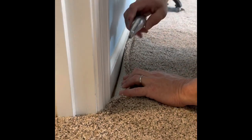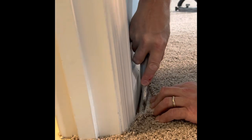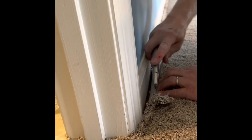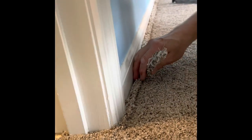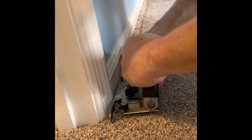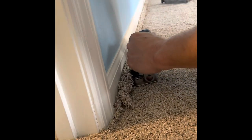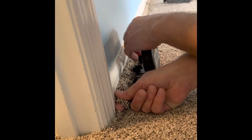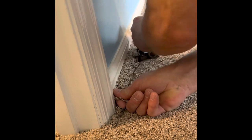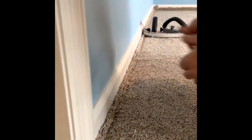Somebody asked me a while back how to trim just a little bit of carpet when it's all soft on the edges and you don't have much to trim. Well, even though it's all soft and rag-like right there, if you have a sharp blade in your trimmer, you can still put your trimmer on it. The thing about this is to keep it from bunching up and wadding all up in front of you and not cutting — keep tension on that. See that? There you go. Ready to tuck.